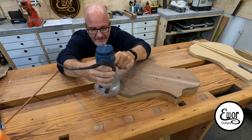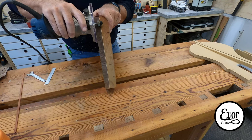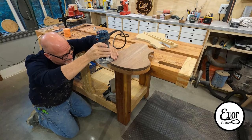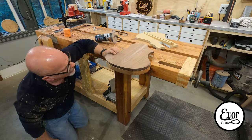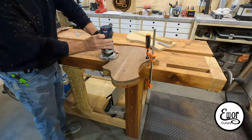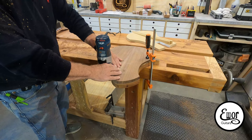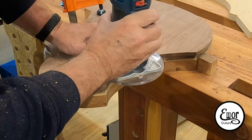I got to come down a little bit — I think that's good. I'm always a little bit nervous when I take a router to a body like that, that I've got a tremendous amount of work in so far, where almost anything could go wrong and really screw up a lot of work. But I'm just being really careful, taking my time. I do a little section at a time and make sure I keep downward pressure on the inward facing side of the base of the router so it doesn't wobble, and just take my time going around it — and everything turned out well, turned out really nice.